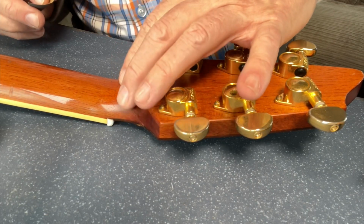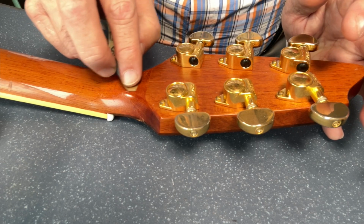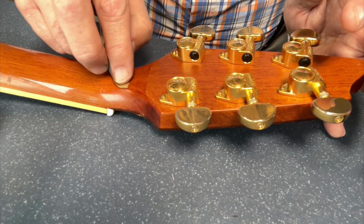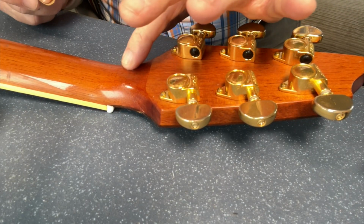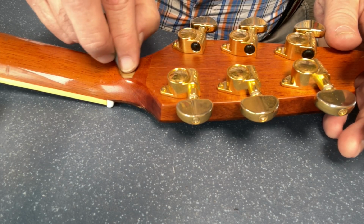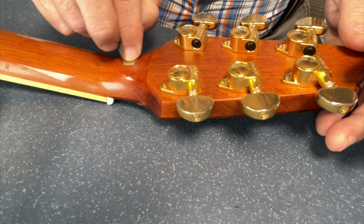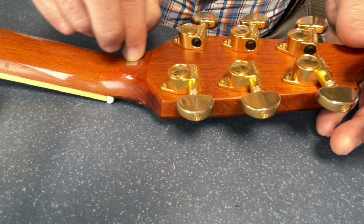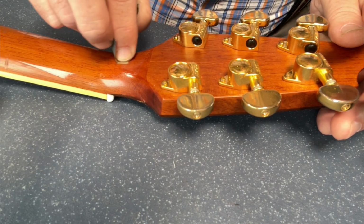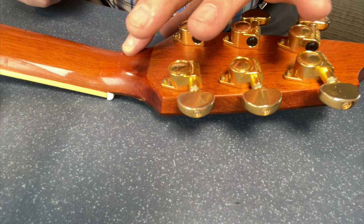So we're about 10 minutes down the road, and that should be warm, dry now. I'm using 800 very gently because I want to just try to take off the super glue and not go too far past the lacquer, because the lacquer will then split. So I'm using wet and dry 800. And I can feel it more than I can see it. And I'm hoping that the super glue was thin enough to penetrate beneath the lacquer. Well, that feels smooth, but I'll just go a little bit further. That feels pretty good.